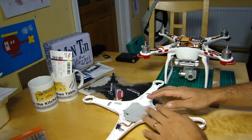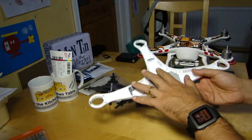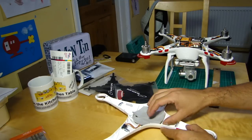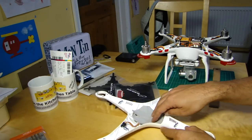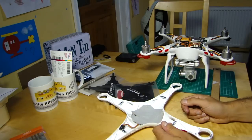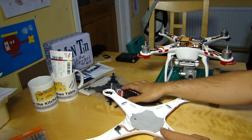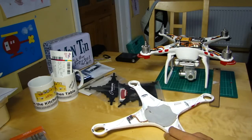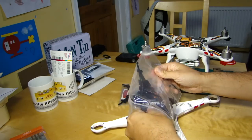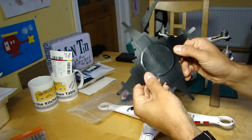I showed you a really simple mod that doesn't involve anything except moving a bit of sticky shielding and changing the location of the GPS wire to make it more shielded. That helped some people - like me - get a couple more satellites, was neutral to others, and some people reported worse. Then Buzzcam sent me a special little thing they designed - a more elegant solution - a shield that clips into the top shell and creates a bit more boosted shielding.